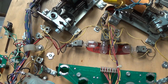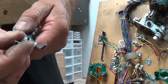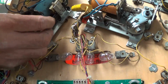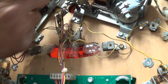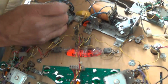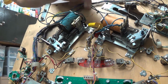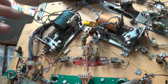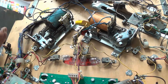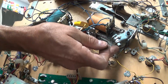And they give you a tension spring that goes on this tab, which actually hooks onto the bracket for here. There's a hole here you can use. So you could actually change this over and use this hole to return it. Are we going to do that? Yeah, you can. Since this bracket has the holes, you can do that. Some of these early games did not have the holes in the end of stroke bracket, so those are the ones you cannot. This has the holes, and you hook it on the end and go out to the tab.